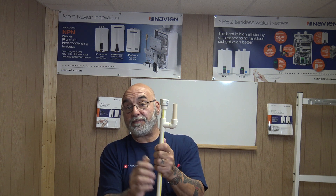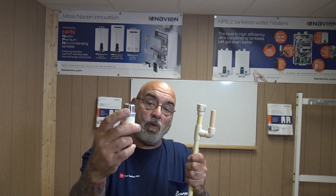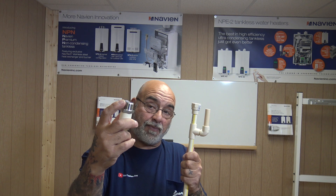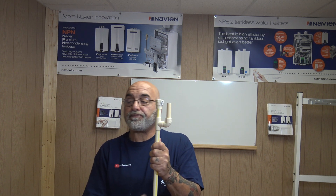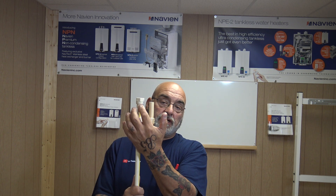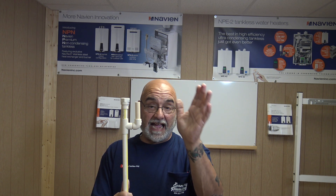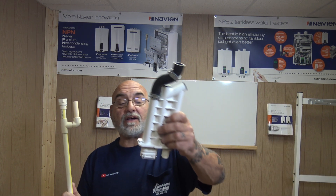So plastic female adapter, or CPVC female adapter — not a transition. I did not have a female one in half-inch, but this is three-quarter male. You do not want one that has the stainless steel, copper, or brass piece, because this will rot out in a matter of months and you'll just be draining condensate on the ground. You want a two-inch piece, and you want this T to be as close as possible to the condensate trap — your T, your street L, and then your vent. That's very important to vent the condensate trap to let it drain out.